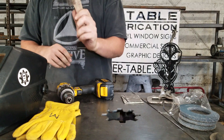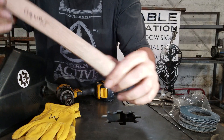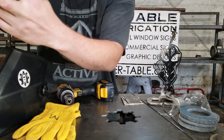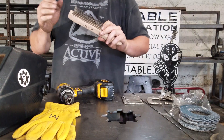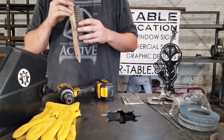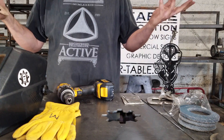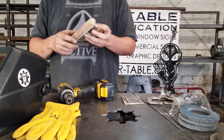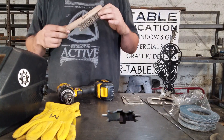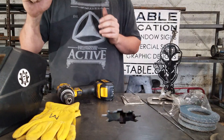You're also going to need a brush that is only for stainless. You need to write 'stainless' on it and keep it separate from all your other brushes. Because if you use the same brush for all your metals, you're going to put iron into your stainless and then it's no longer going to be stainless anymore. That basically defeats the purpose of using stainless steel in the first place and spending all that money. So you're definitely going to want a set of stainless tools you keep separate and labeled.